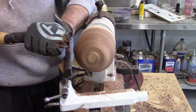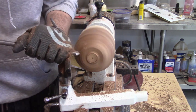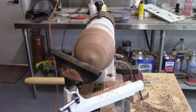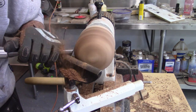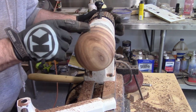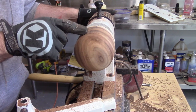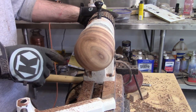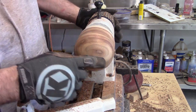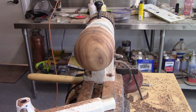That's looking good. I'm going to fill some more cracks here – just some deep pockets it looks like. Then I'm going to switch, rather than continuing with the 100-grit, to 220 because it is pretty smooth. I got some fine cuts on there and I don't need such a coarse grit. Go ahead and fill that in really fast.